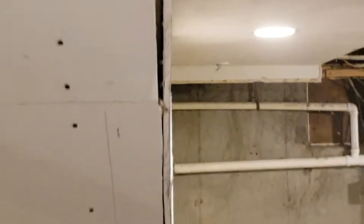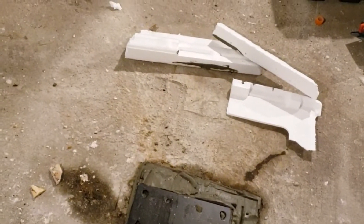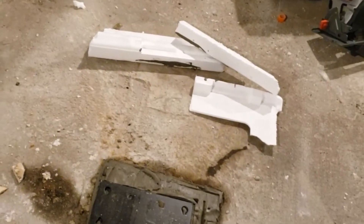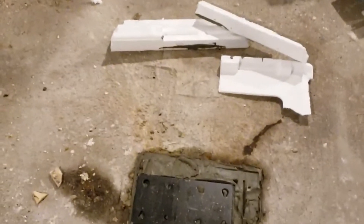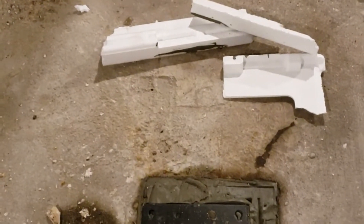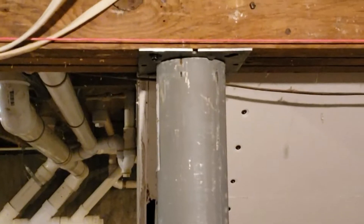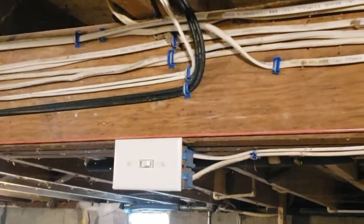That's just the way I'm doing it. We're concreting the pad in because there was a column there — we had to fill the hole and grind it down. The floor is so unlevel that we just leveled it off with some concrete. For this one, there was no column here; there was a 2x4 post with a light switch on it. We moved the light switch and put the column right down to the base concrete.